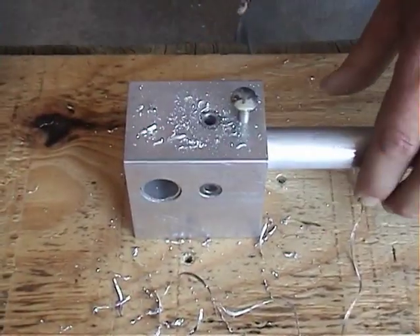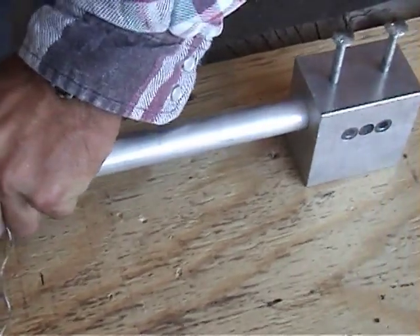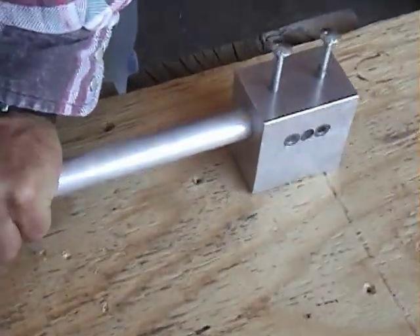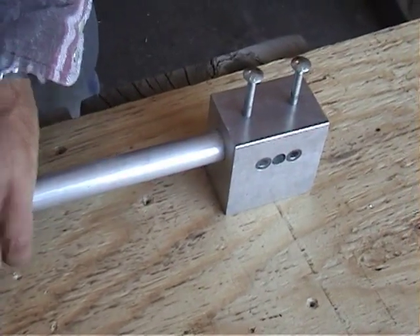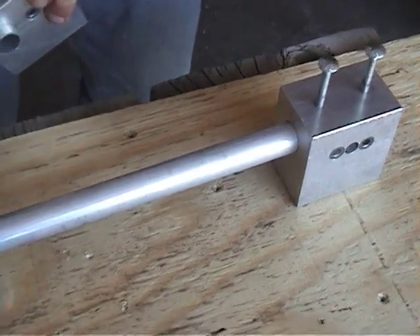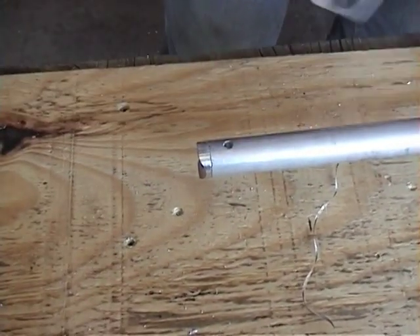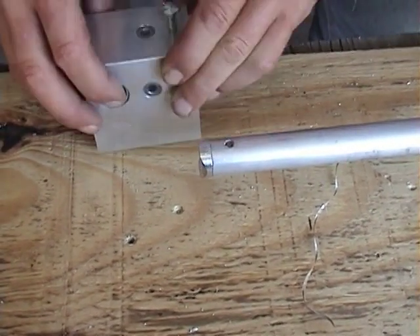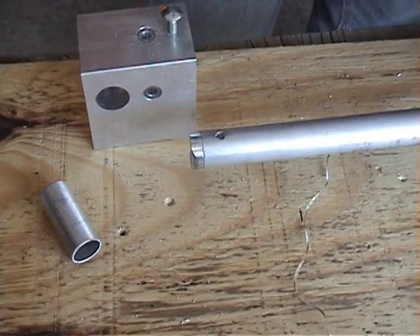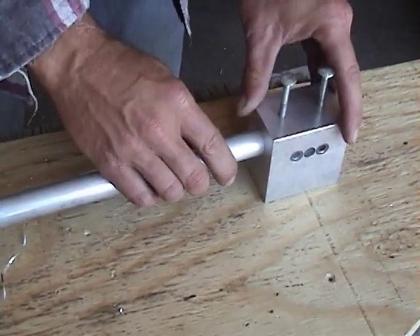Time for a battery in the drill. I see Jeff, you're using this one on the other side to keep it square. That's correct, we're just holding our height — it makes things easier. That other drill guide is going to come into play, real important when you do the other end of this tube, because we want another stubby in the other end, and we want it parallel with this hole.